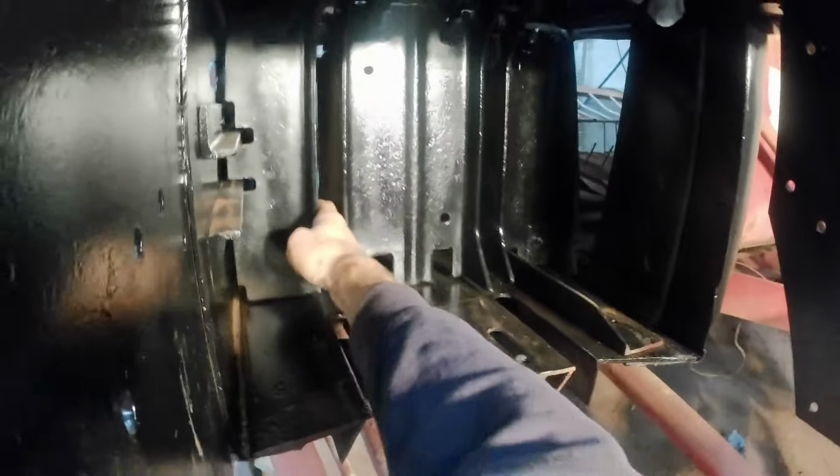That's awesome. And you can see the two knives, when I was telling you about that angle, they're close at the bottom, but if they were to touch, the way that angle's cut forces them apart, and then it's a close clearance the rest of the way up as it cuts. That's just pretty cool. I knew it would slide better. I don't want it to go out the back. I mean, it's just sliding because the baler's tilted downhill, that's all it is.